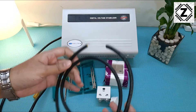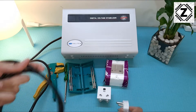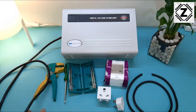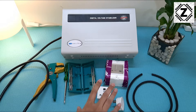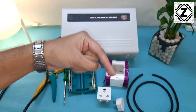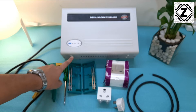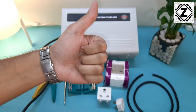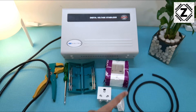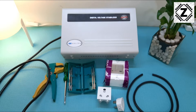If you are running an air conditioner, make sure to get a 2.5 square mm wire - not any less. For running AC you need two modifications: one is a 16 amp plug and the second is a thicker wire. We are going to need a plethora of tools - wire strippers, screwdrivers and all of that. If you want to buy all of this stuff online, there will be buying links in the description below, including the material, tools, and the stabilizer itself. Please use my affiliate links to support this channel.